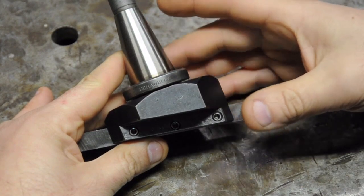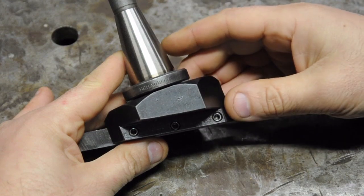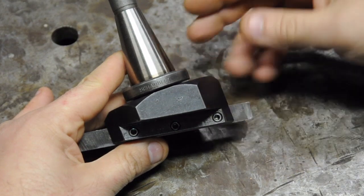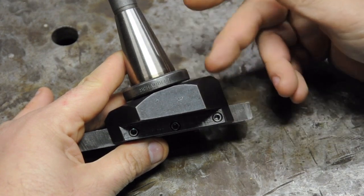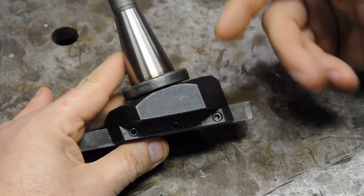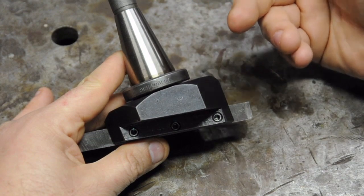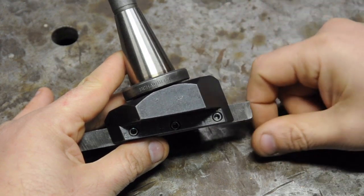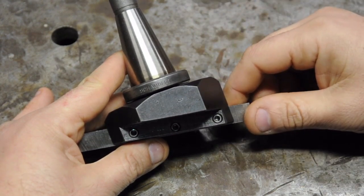Just like anything else, you'll want to keep a fly cutter — or any tooling — suited to the size of your machine. My mill happens to be quite stout and heavy, so this amount of imbalance really doesn't make a difference. You can try to split hairs and find defects in surface finish maybe caused by the imbalance, but the reality is a slight change in feed rate, nose radius, or rake might fix that surface finish problem.